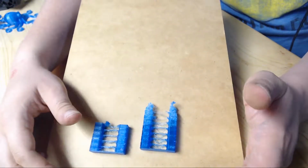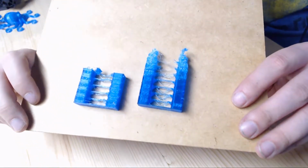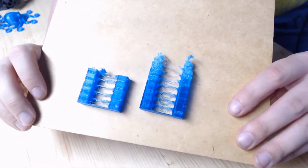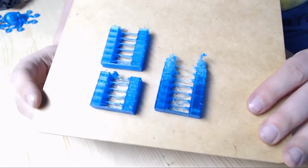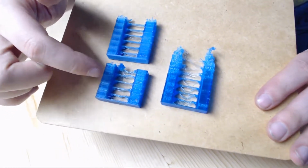Thankfully, TPUs are quite easy to dry out in a food dehydrator. I ran it through overnight and I was getting much better prints, though it could have used a little more time, as you can kind of tell here. I did since let this filament sit out, and I was able to replicate the tower that's on the left here, sorry.